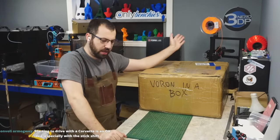So, is it flat? That's the question. Because there's two different things you're looking for. There's flatness, and then there's like, I'm trying to remember. It's been a while since my metrology class, okay? But basically there's flatness, which is the difference between the highest point and the lowest point. And then so it can be flat, but it could also be curved, right? So if I were to shine a light under that.